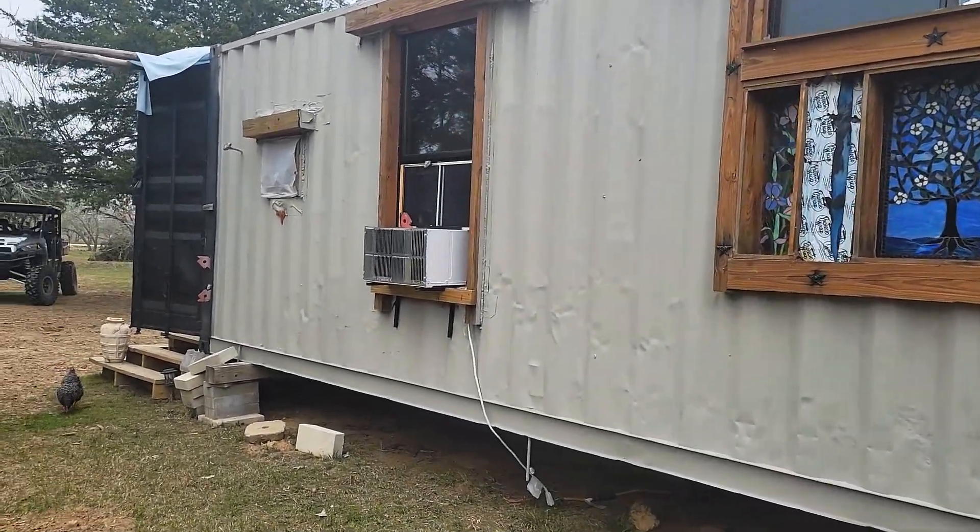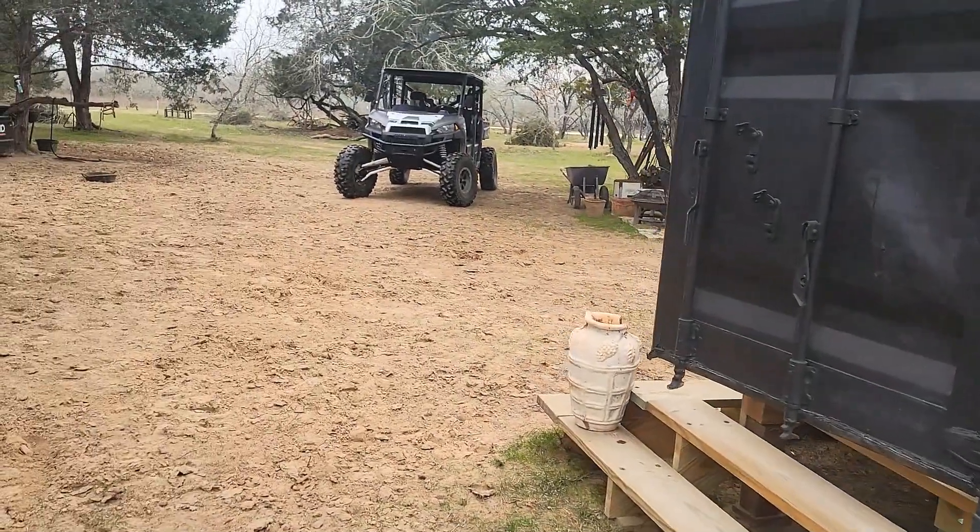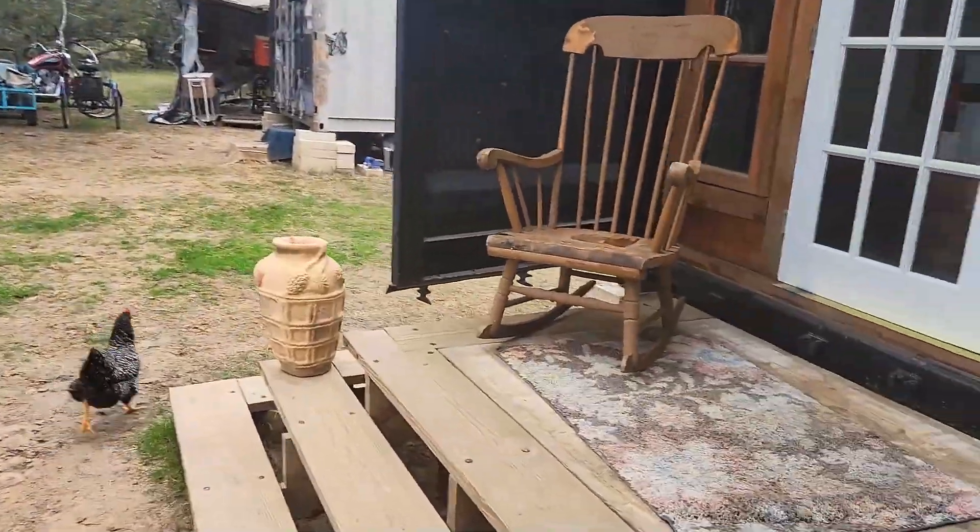All my windows still need storm windows this year. I'll look at the specs on this heat pump — I believe it's designed for about 1,200 square feet. Originally I bought exactly what a shipping container would need for 320 square feet of heating and cooling — it could not keep up. Then I went to 680 square feet capacity — still didn't work, it overran. So now I'm running three or four times the capacity I'd theoretically need given all the insulation, and now it works just fine.